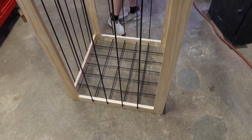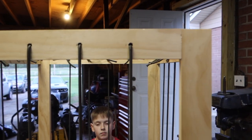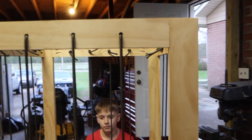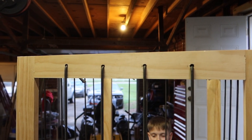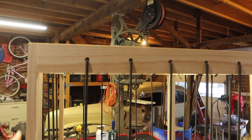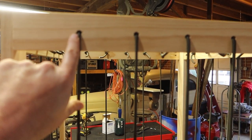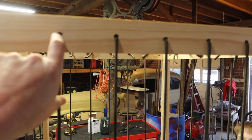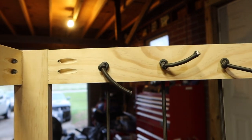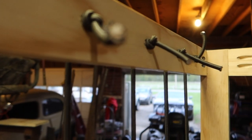This is made out of standard one-by-three pine. I cut the inside pieces here — as you can see, we used the Kreg kit; those things are amazing, it just makes it a breeze and it's a really tight joint. I cut these at 21 inches, and the spacing of the holes is four inches each. On this side I have five holes instead of four, and this piece is 24 inches long. I did the spacing at four and three-sixteenths inches, so that gives you even spacing. On the inside we just tie them off — makes it easy.